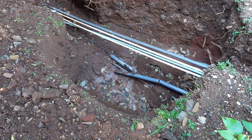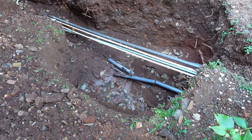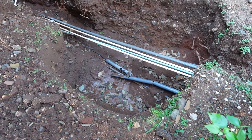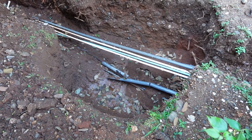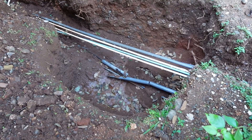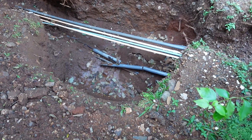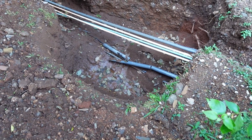The gray one up top is thin-wall PVC - sanitario we call it here - that's inch-and-a-quarter, which fed from the house back down to the casita. Now we're going to turn that around and feed the power from the casita up to the house, and from the new panel to the casita. We'll be reusing that inch-and-a-quarter but abandoning the two-inch. That's when we decided to quit digging and use the inch-and-a-quarter to go up to the house.